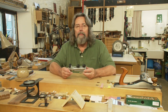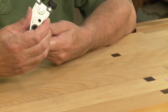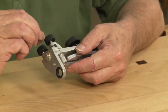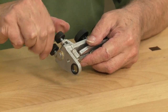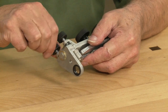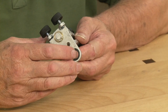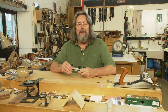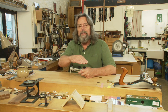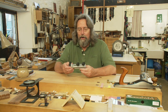This jig however seems almost perfect. We have here at the right hand end two little knobs, and if I undo them you'll see that the bearing at this end can move from side to side. As that bearing moves from side to side the blade moves from side to side on the Tormek stone, as I'll be showing you a bit later on. And we can grind a camber.